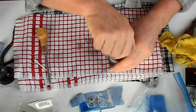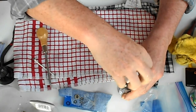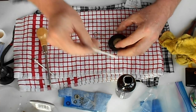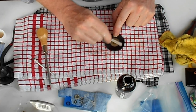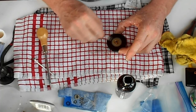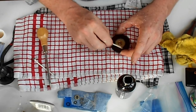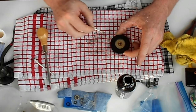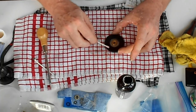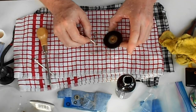Okay, so it's time for rubber renew. Take the top off. It's a bit smelly. Now this wheel has some gunk here, I don't know what it is. It's not on the edge anyway, but I'm going to see if this will remove it. Just give it a once over. Weirdly enough, it's not taking a lot of the rubber off the side. I guess that's not really a contact point. It was around the edge. I'll probably find, if it's anything like the pinch roller and the other piece I just did, that it will take a lot of rubber off. Anyway, I'm just soaking it in this, just working it in. That seems to be soaking in okay. I assume that's all right. It's going to restore it, put some elasticity back into it. That's what they say.